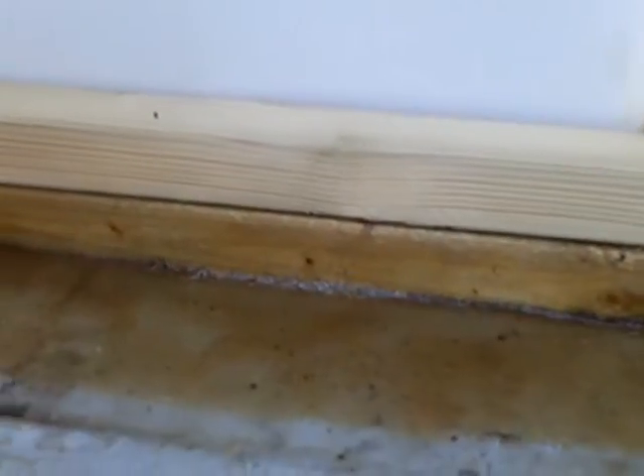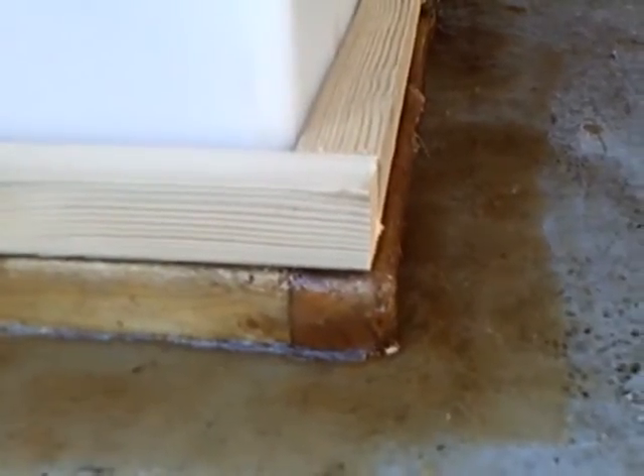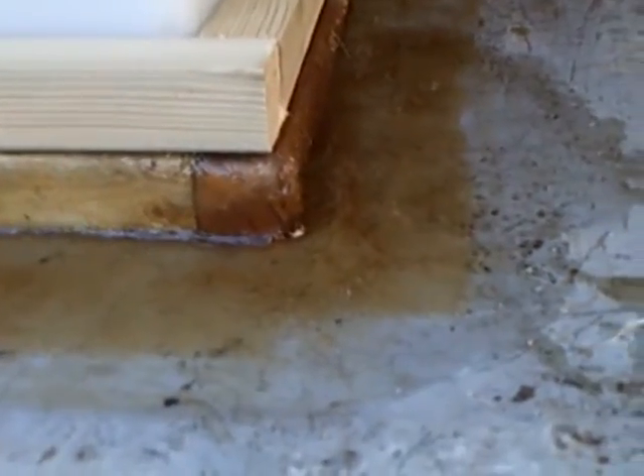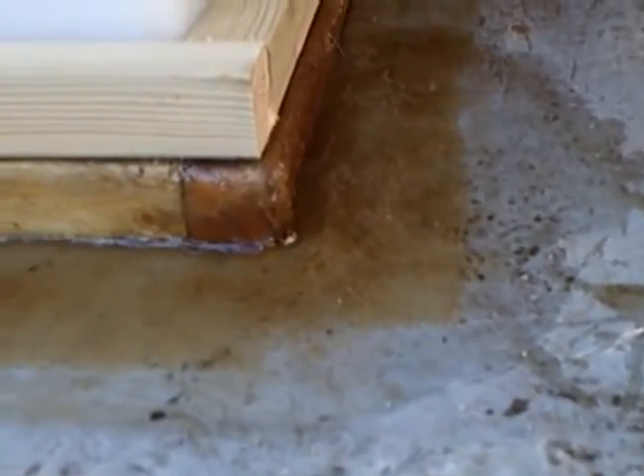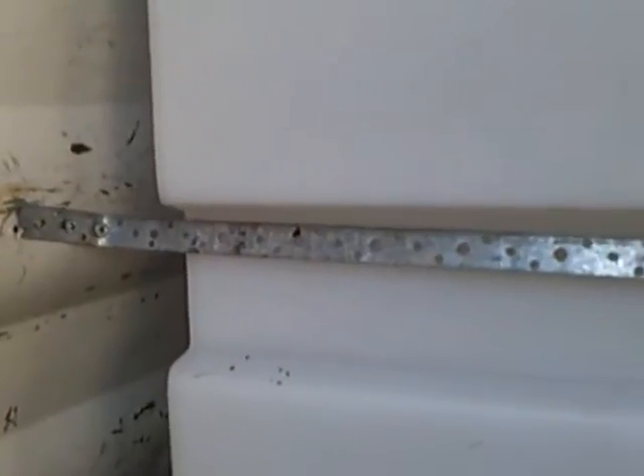As you can see, I've got fiberglass all the way round now — I've bolted it to the bottom. On top of the fiberglass I've then put another 2x2 which I'm going to build my framework to. Later on I'm going to get some hardener and grey resin and paint that all the way round to match in with the rest of the floor. As added protection, these are builder's bands all the way round the outside, going right round there, and I've fixed them to the bottom. There's a plate the other side in the cab which is screwed in, so you've got 4 screws through there and screwed to the bottom — this is absolutely solid now.